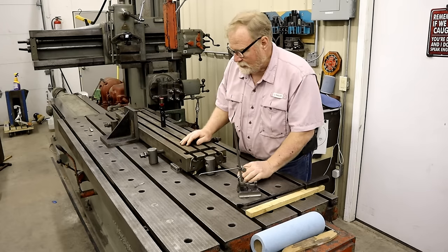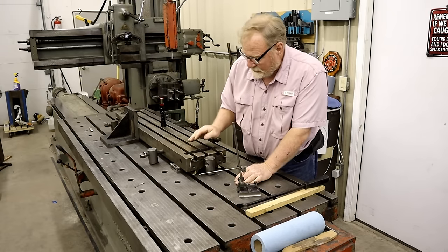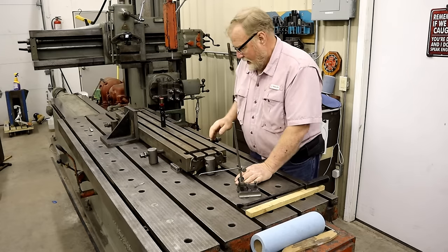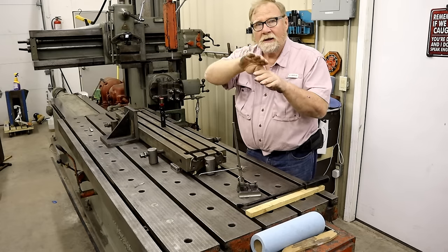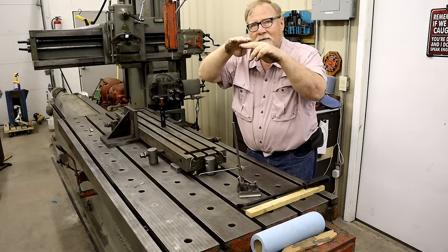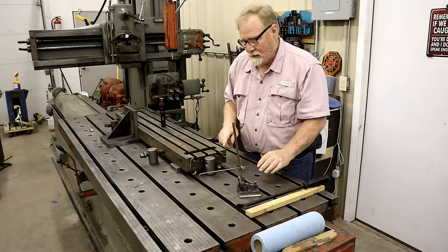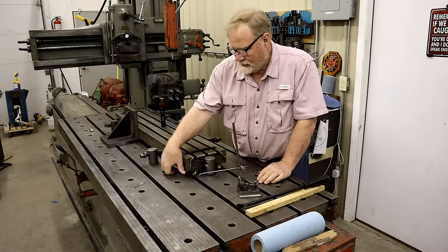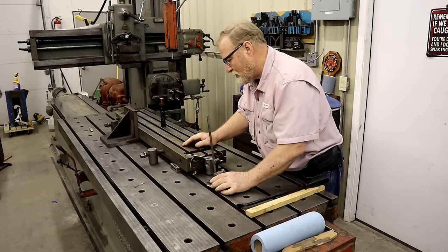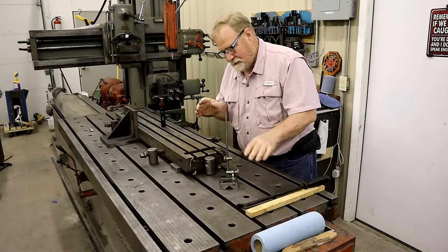So what we do is these keep it from going sideways. This is an end stop, and I have 1-2-3 blocks under each corner. Because it's bowed, where I put the 1-2-3 block on the side, if I follow that curve, it changes the elevation out here on this point. So I can move these blocks individually, get them close, which I have. This is a down and dirty way of doing it. I've gone through all four corners now. Check this out. Everything's fine.